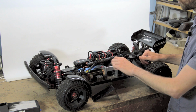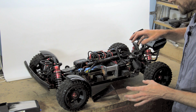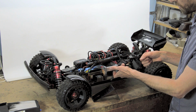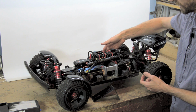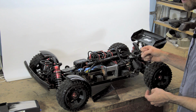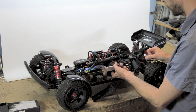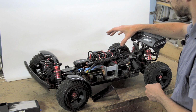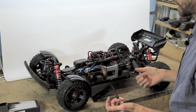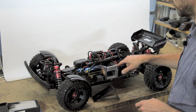I've seen other people do dual motors where it's two motors running on a single gear, and what I came to the conclusion was, if you've got one motor that's not quite in the right timing as the other one, and both of those motors are running together, if one of them decides not to behave, then I can see it doing some serious damage, because there's a lot of watts going through all of these. So at least if this one has a problem independently, I can tell when I'm driving it that the back has failed, because it's just got front wheel drive, so it's not overpowering the other one basically.